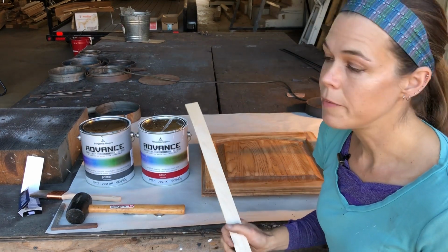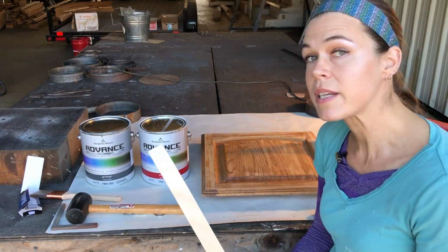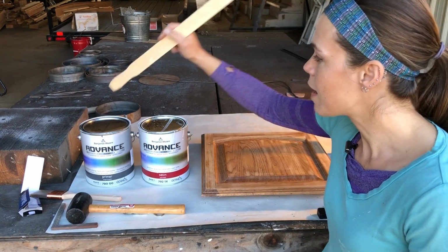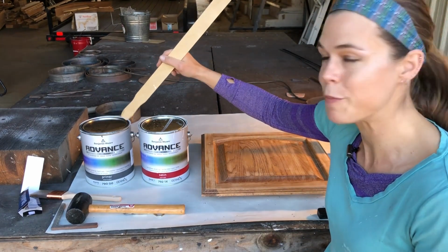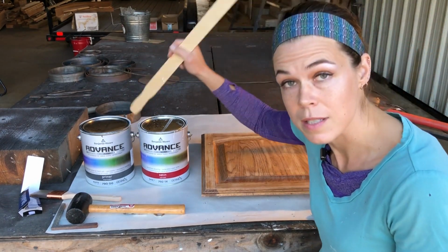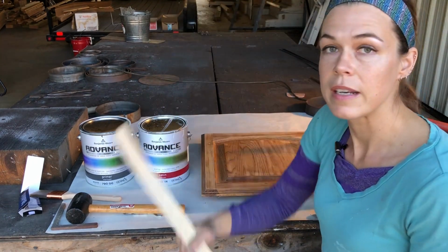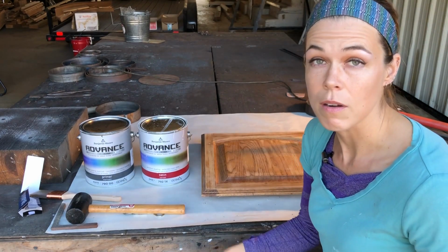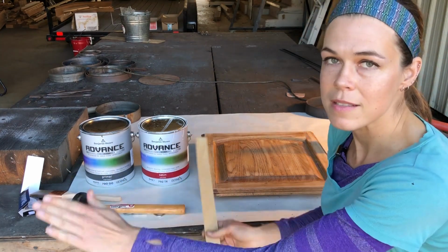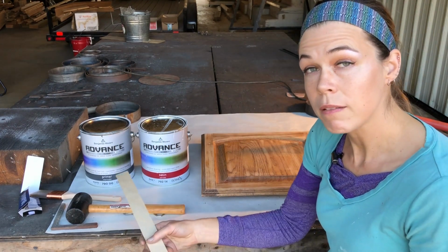So you need to choose your paint color. You should get a primer that is slightly tinted with that paint color, because it'll make it easier to cover. And you guys, I am not getting anything for telling you how great this Benjamin Moore paint is, but this is what I would actually recommend. And I'm not gonna lie, this stuff is expensive, but it goes a long way, and the finish on it is the best that I have ever seen on paint. Not to mention that somehow these scientists here managed to create a water-based paint, so that means it's not fumey like oil-based stuff is.